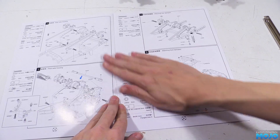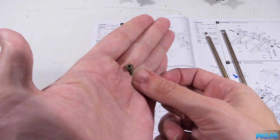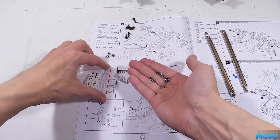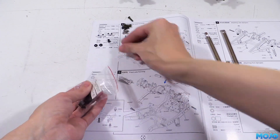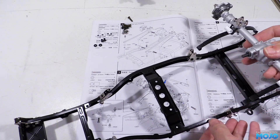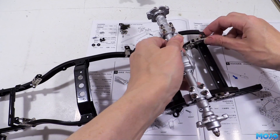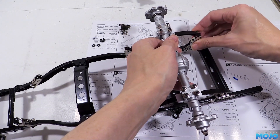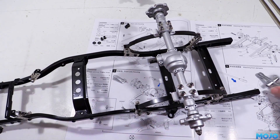That was step one, so on to step two: mounting the rear axle. We'll be needing four M3x14s, which look like they have a layer of something light orange on them - possibly rust, but that's usually a bit darker. We're also going to need two M3x10s, four M3 nyloks, four aluminium casings which are just short tubes, two O-rings and two of the flanged tubes, and of course the rear axle and the chassis. First, we'll use the four long screws and the aluminium tubes to get the end of the leaf springs attached to the chassis. It's as simple as popping a tube into the loop on the end of a spring, then passing the screw through from the outside. When fitting the nuts, they should tighten up to the aluminium tube just fine, but just in case, make sure everything moves completely freely.